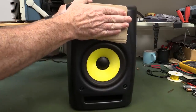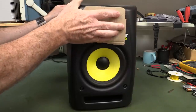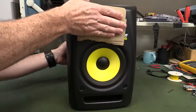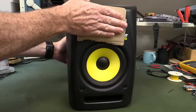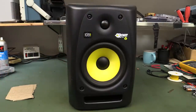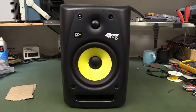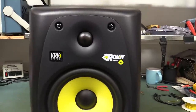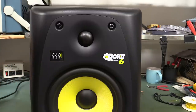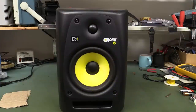I know it's probably not good to do this because we could damage the tweeter — or the tweeter could already be damaged. But we have to look at the symptoms, so let's plug it in. Whoa! Wow, I can feel that vibrate! That poor little tweeter! The amplifier must be oscillating and putting the full rail voltage square wave into that thing. That is horrid! Let's take it apart.